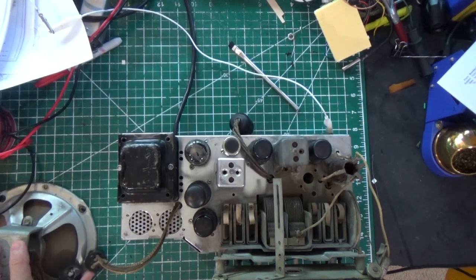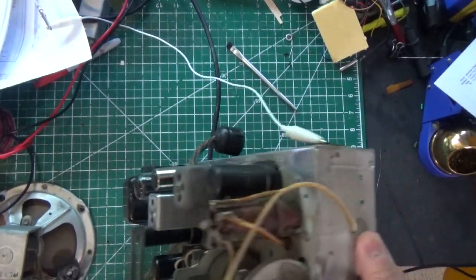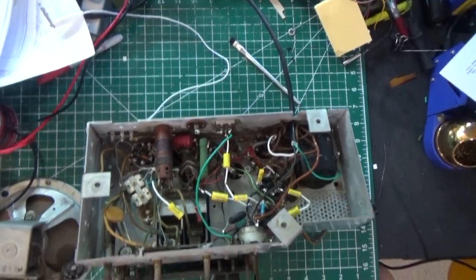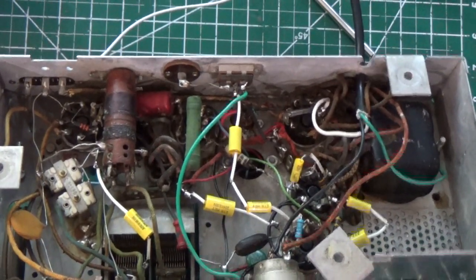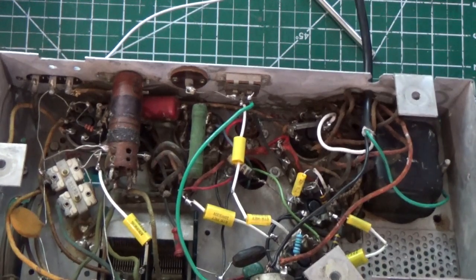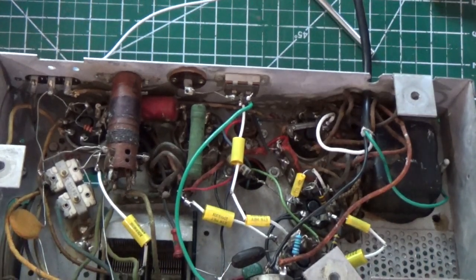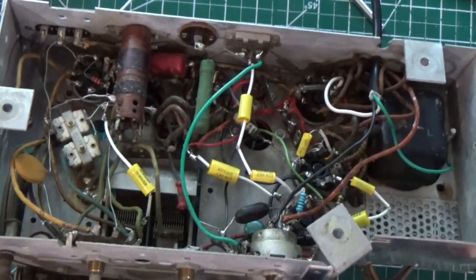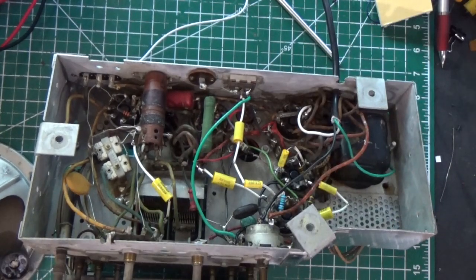In the last episode I told you I was going to replace the capacitors, which I did. Let me show you what that looks like under the radio. You'll notice I replaced all of the old caps. In the last episode I mentioned all the caps in here were 0.47s when the radio doesn't call for any of them — someone had a bunch of old caps laying around and threw them in. We now have the proper values installed.